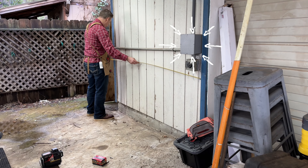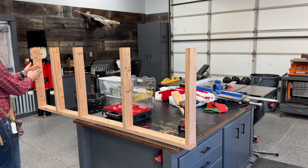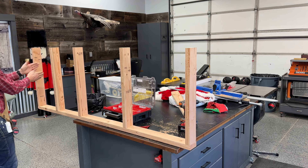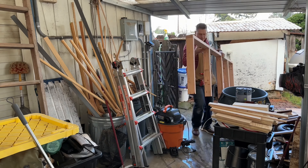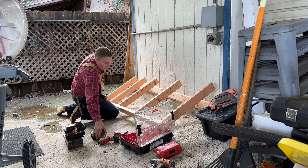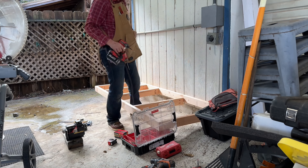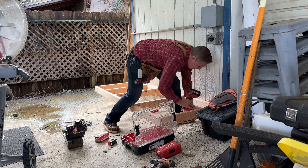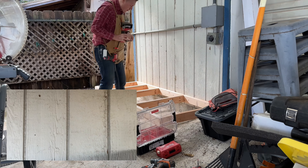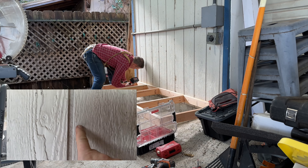Now, as we look at the spacing, you can see that it's 24 on center. If we were to do 24, it'd be right here, but the reality is that it would make it too close to the end. So what I did is I took that overall space and divided it in half, which placed it right here — that's also why it looks a little bit off-sided or uneven. But now we're going to take that bottom shelf and install it into the cleat itself. We know where the studs are so we're going to be anchoring down into that.